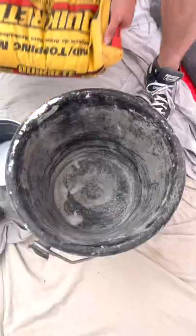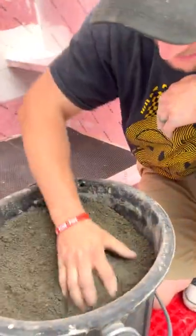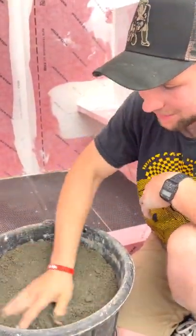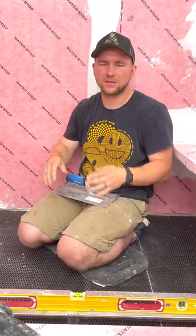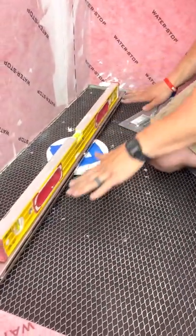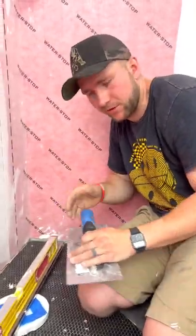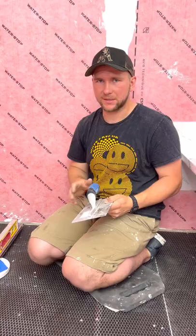This is the consistency you want — kind of wet sand that you can really pack nice and easy. You grab it and it stays clumped up, then you drop it and it breaks apart. If you have it too wet, it's going to take forever to dry. People over-complicate mud jobs and get intimidated by them, especially the linear drain ones — they're so easy. You have a flat piece for your linear drain, you set it level by packing under the drain itself, then you have a ramp on each side to drain the water toward the drain. Flat, ramp, ramp — that's it. Don't over-complicate it.